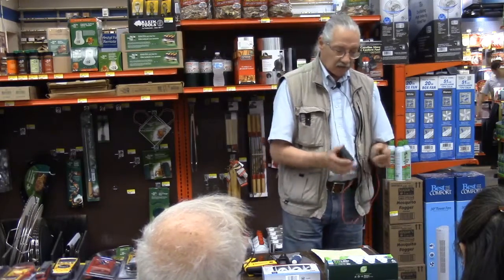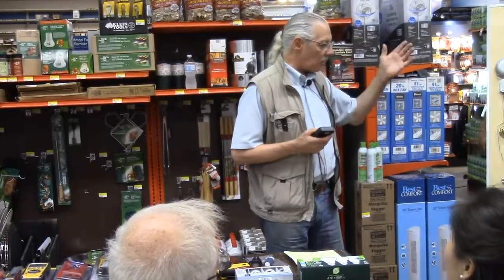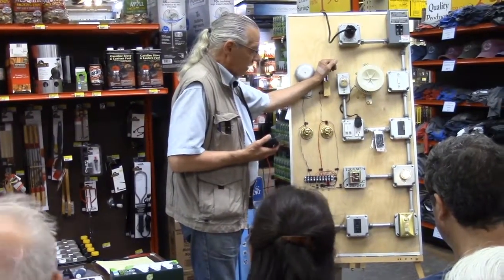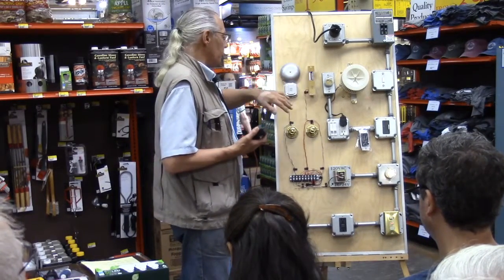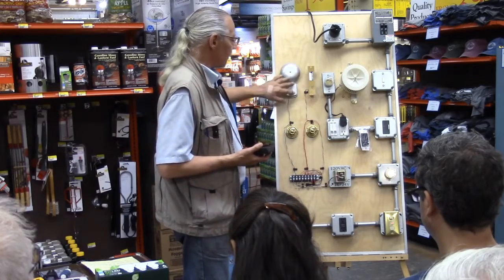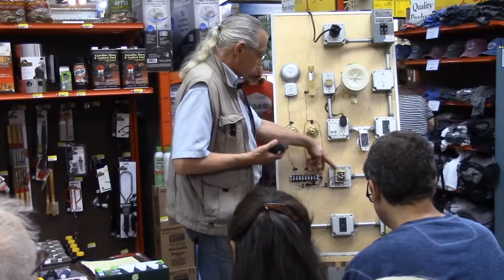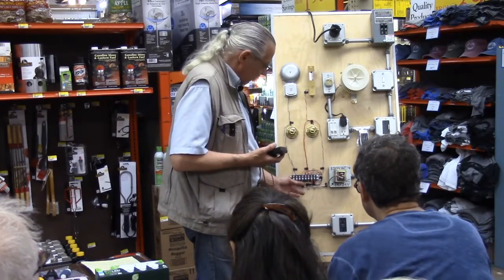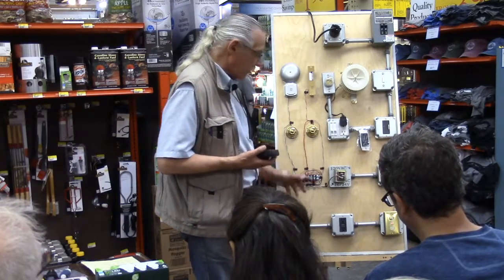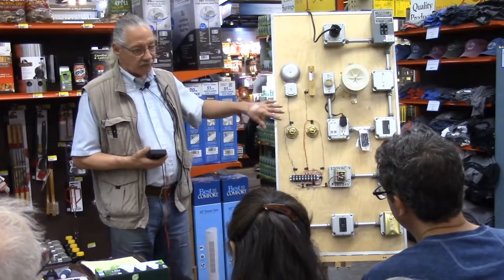Most meters will have AC and DC measurement. Most of your household is all AC. The only time you'll get into DC is usually in your intercom and or door lock circuitry. I just happen to have this one set at 24-volt DC. This is running AC — coming off a transformer that is AC, but I've modified the voltage with a diode to make my own DC circuitry. That's what it's for — we do that all the time in lock work and intercom systems.